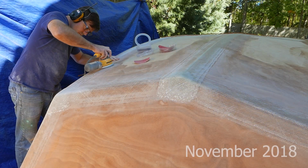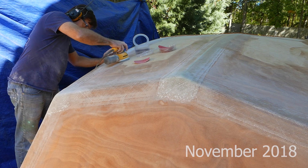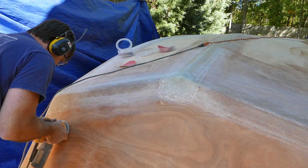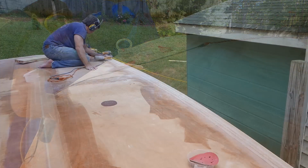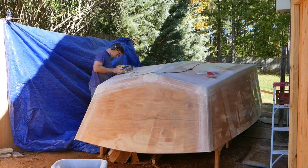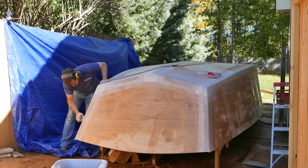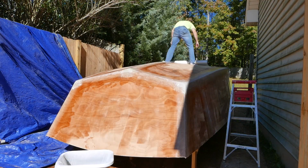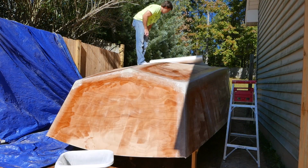After all seams were taped and cured, we again used a sander and power planer to remove the remainder of the original panel splices. With the seams taped and the panel joins still supported on the other side by another tape splice, everything held together fine. We sanded the edges of the tape to taper and smooth the transition with the rest of the hull, as well as to facilitate a bond with the bottom layers of fiberglass.